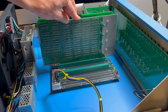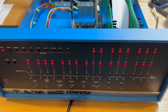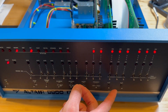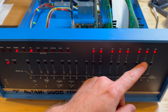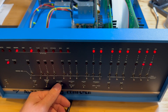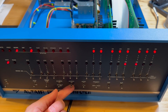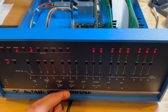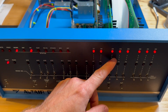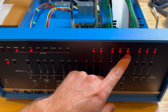Let's install this board into the next slot of the backplane and try it out — the eBay listing stated it was a working board. With the computer running, let's do a hard reset by toggling the stop and reset switches at the same time. That resets the CPU, which is good. However, memory address zero is showing all ones, which is unusual. Trying to deposit zero into address zero should turn off all the LEDs, but it's not doing it. So something's up with our RAM board — it's either not reading or not writing properly.